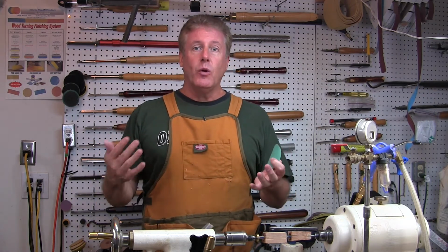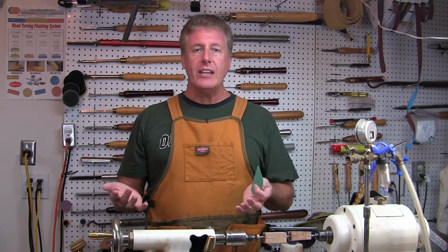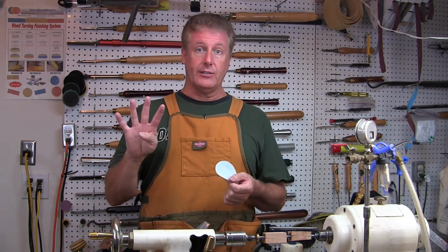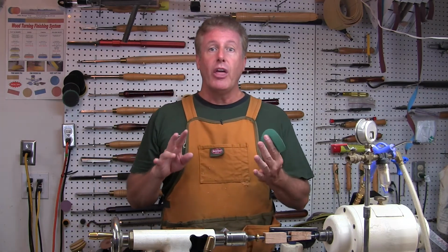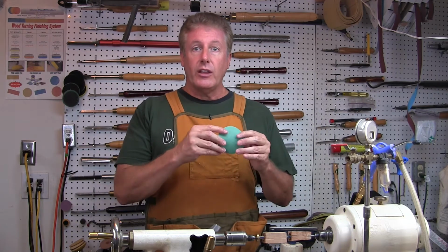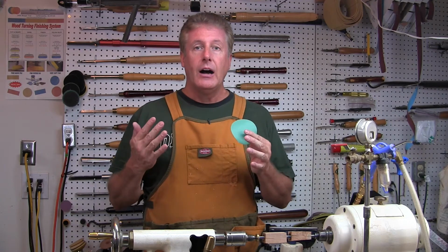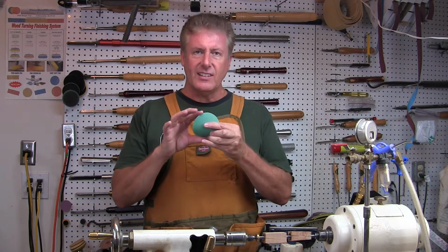So that's 80, 100, 120, 150, 180, 240, 320, 400, 600, and 800. It's available in actually 4 different sizes. Have it in both 2 3/8 and 3 3/8 so that you can use it with, as most people are sanding on the inside of their bowls and platters, that extra 3/8 allows the disc to roll up over the edge. And it's a consistent edge.